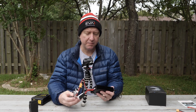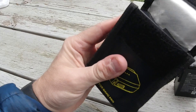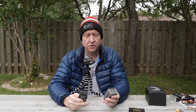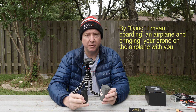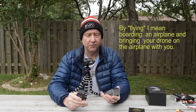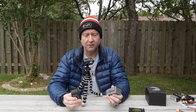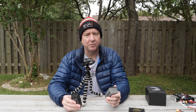But what if you want to store a DJI battery? This is a battery for the Mavic Air, and this is a battery for the Mavic 2 - it works in both the Mavic 2 Pro and the Mavic 2 Zoom. If you want to store it for a period of time, or you fully charged them with the intent of flying but the weather was bad, you don't want to fly with fully charged LiPo batteries. The energy in these things is explosive - it doesn't mean they're going to explode, but you're much better off flying with batteries optimized for storage because they're going to be less volatile. If you are planning to fly and then put them in storage after, you want to get them down to that optimal storage level, which is about 60%.